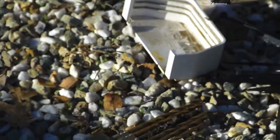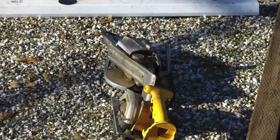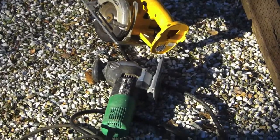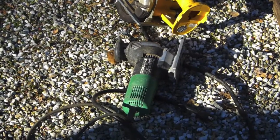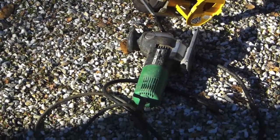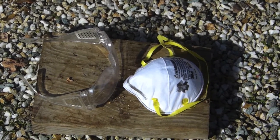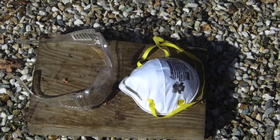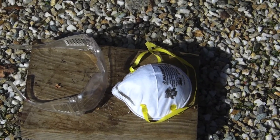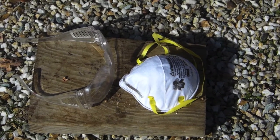You're just drilling wood, so the drill bits can be cheap. You're going to need some kind of saw to cross cut 2x6 lumber — circular saws work fine, or use a jigsaw if you're not comfortable with circular saws. There's just not that much cutting, so use whatever you feel safest with. You're going to need safety glasses when you use a nail gun, and a good mask when cutting pressure treated wood and cedar. You absolutely do not want to breathe in pressure treated dust, and cedar dust can be very problematic for some people.